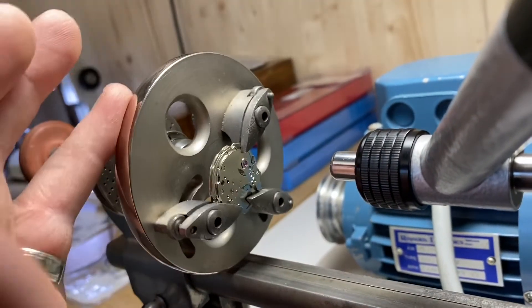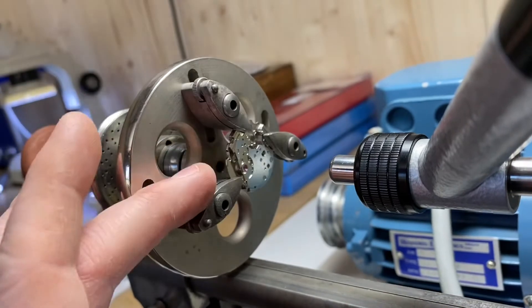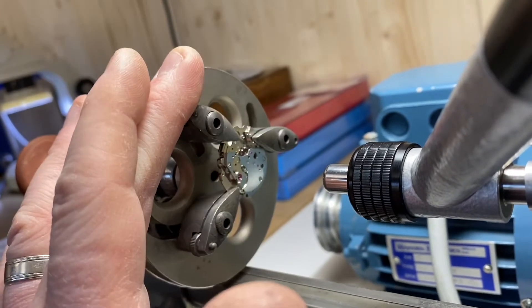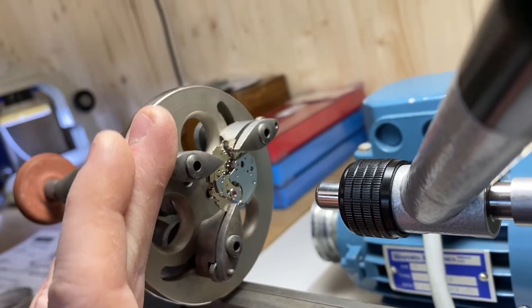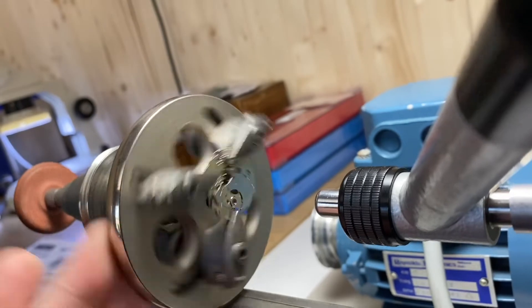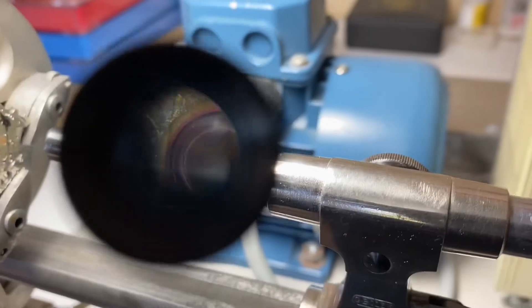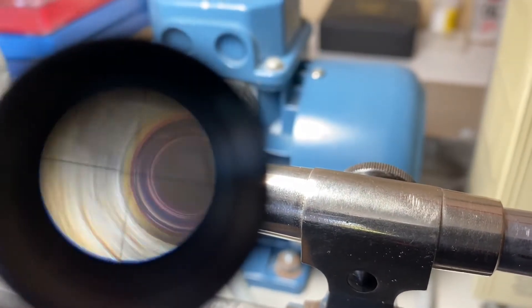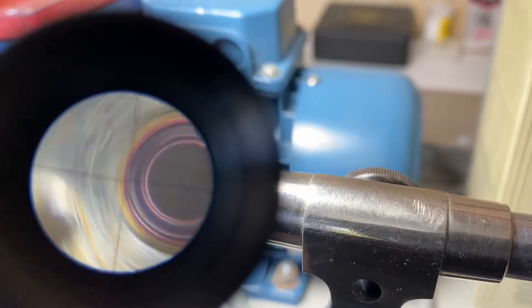It's important to make sure that you don't clamp your clamps onto the bridge. Because if you're clamping the bridge, you won't be able to remove the bridge. So you can only clamp on the main plate itself. What I'm going to do now is take the bridge off and we're going to look at the hole that I've already drilled. We have just the main plate mounted now — let's have a look. We can see a small wobble. That's due to the fact that when we drilled it, we used a drill bit.